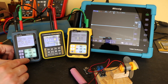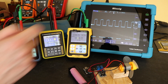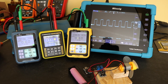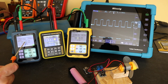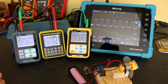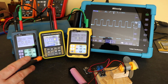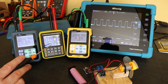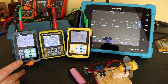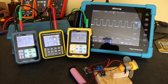We'll set it to 40% and 100 Hz and turn it on. You can see the output signal on the screen. For the SG-004A measurement we've got 39.9% — that's the 40% — and a frequency measurement of 100 Hz. For the MR9270S we've got 39.9% and 99.999 Hz for frequency, so a lot more digits on the MR9270S for measuring frequency than you get with the SG-004A.